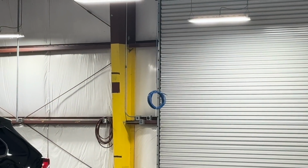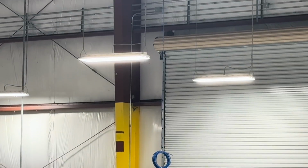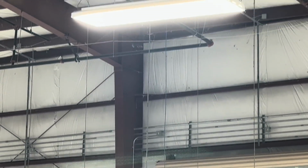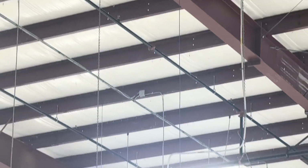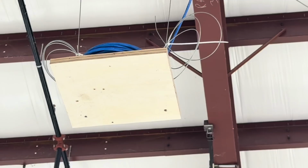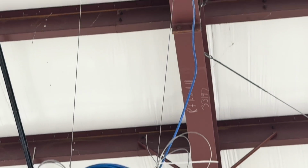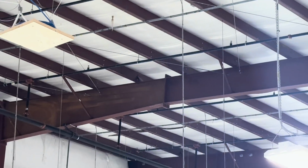When it comes to dressing the APs, the end user had an interesting requirement, which was that they wanted the APs to be in the wide open area, hanging at the same height as these lights. To perform this, we hung the wire down, and then, using the Hilti nailer, we installed steel wire that we hung down to these platforms, making sure that the height was even with the lights. This is where the APs will be mounted shortly.